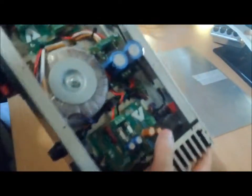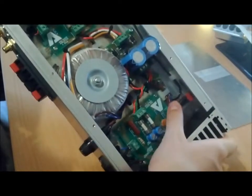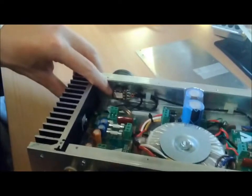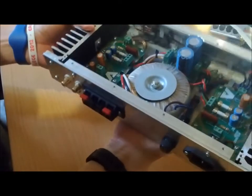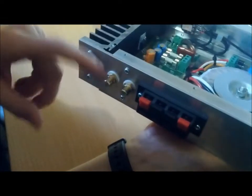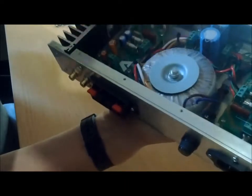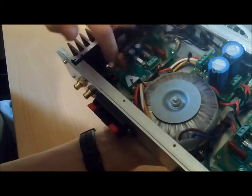The main switch is a double pole switch, rated at 2 amp, 250 volt AC. As I'm only using a 1 amp fuse in the back, that's fine. Just a basic pot arrangement. All ground star points are preserved and everything, so you make sure you ground everything back. That's why these are insulated RCA sockets — so they're not grounded to the case there; they're actually grounded when they go into the modules themselves, grounded through the modules.